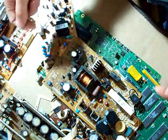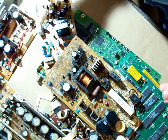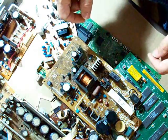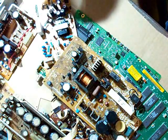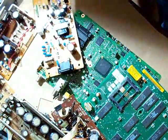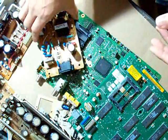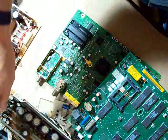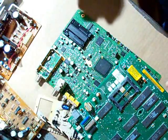I have seen a lot of people take and measure the voltage with it open. That is nice for telling you what the maximum possible voltage is. But then they short it out to give you the amperage — shorting out and giving me amperage tells me nothing, because that is just shorted amperage. I can't tell what kind of power I am going to get out of that, because I don't know what the voltage is while it is shorted. Most likely the voltage when it is shorted is less than one volt.